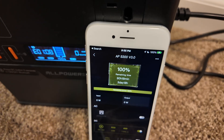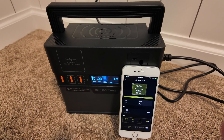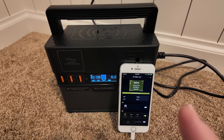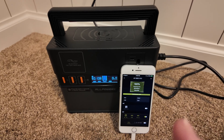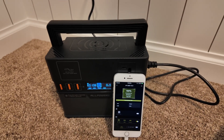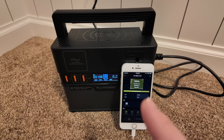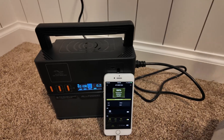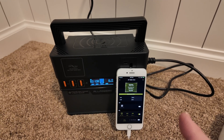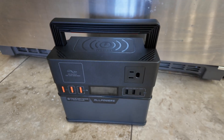It is almost 10 PM and we just reached 100% state of charge. This real-world test revealed something important: when you discharge it rapidly and want to recharge, it can take a long time to cool off before it will start charging — over an hour in this case. It then charged at a slower rate than advertised, likely to keep itself cool, which is a good safety feature. From 28% to 100% took longer than the claimed 1.5-hour charge time. Just keep in mind that if you're in a rush after depleting this unit, recharging may not be as fast as you expect.